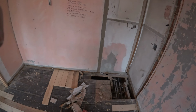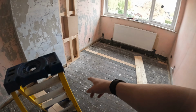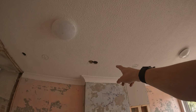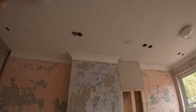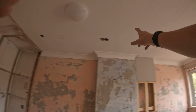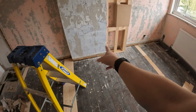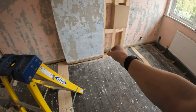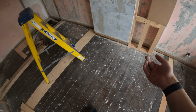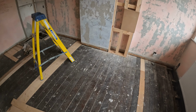I'm going to start by pulling the two out that need to go to, there's a HDMI extender going to a telly underneath here. And there's also a HDMI extender going to a telly here, but we're just going to leave that above the ceiling up there, so the electrician can pull that down when he pulls all these sockets down, because he's got a bank of sockets and brush plates to go in for the customer. So we'll leave the HDMI extender coiled for that one up there, and then down here we'll coil a cable. It's not an HDMI cable, we're doing Cat5 over HDMI extenders. We've used them before for bars and clubs and petrol stations, and it just means that you can split off the signal in several different ways for the HDMIs.